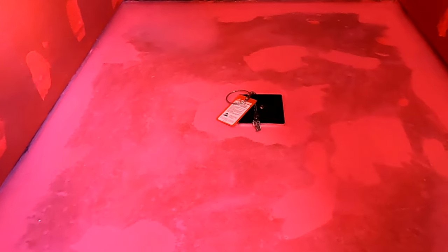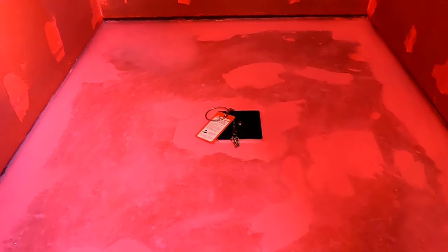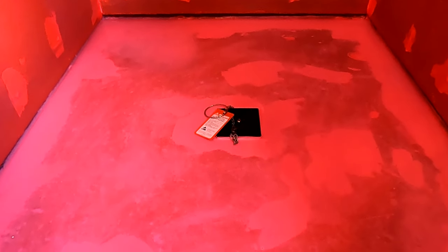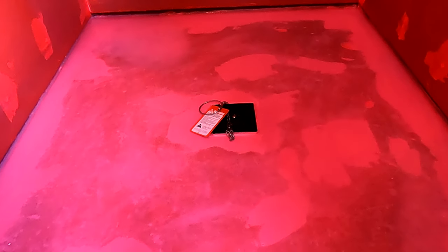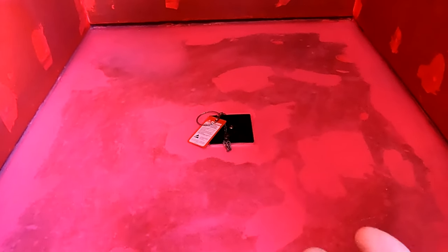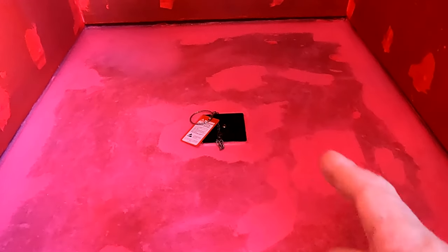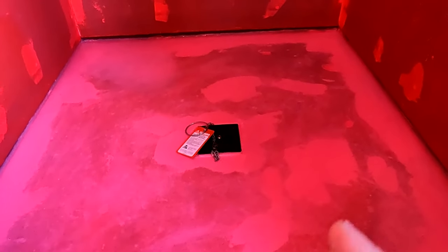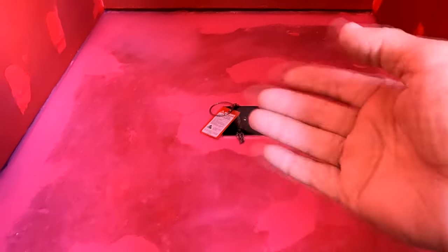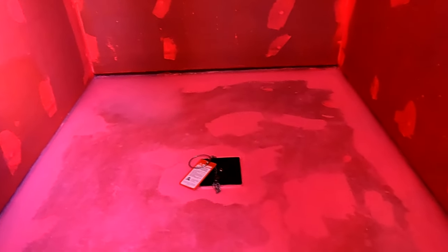The 24-hour overnight test is partly peace of mind. When I say peace of mind — if you're going to have a leak somewhere it's going to definitively show below the surface. So with the secondary test you're not looking for a leak from the liner, you're looking for a failure of the waterproofer. The failure of the liner would be identified in the prior test.